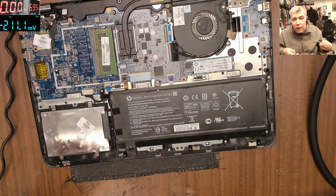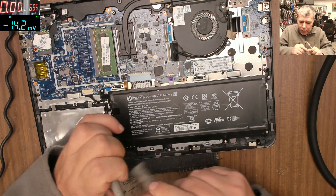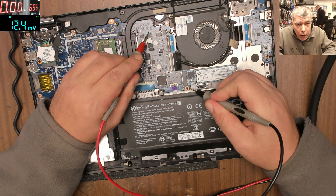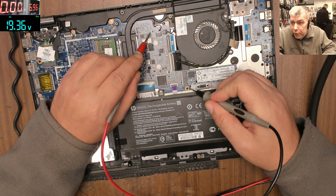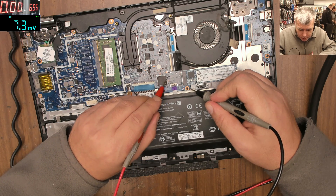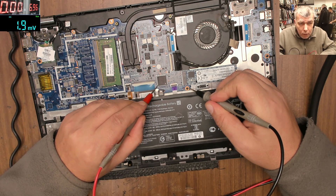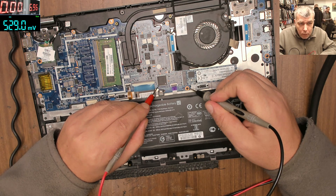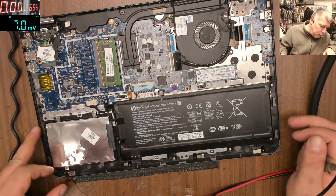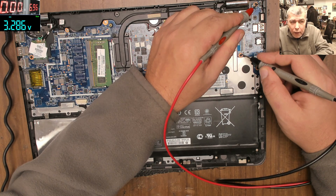So what we can check basically - we have the orange light, so that means we have 19 volts, and that means we have 3.3V. We can confirm this on the power supplies. 19.3V you can see on the screen, so we do have the main power rail. On the Super IO we also have 3.3V. I check on screen and have like 3.2V just checking on a random pin near the power button. The power button is here and we have 3.2 volts.